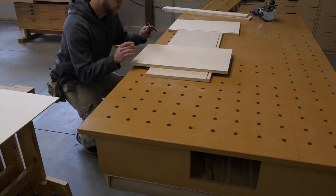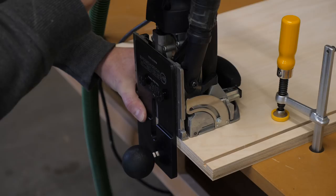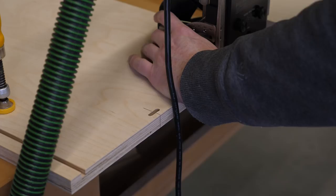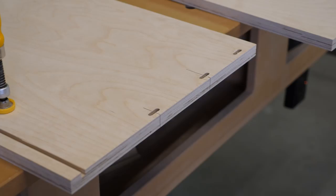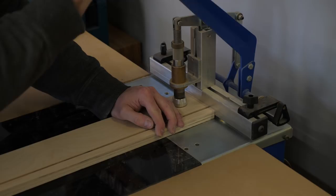On to the joinery. I line up and lay out the bottom and sides and make a couple of tick marks across the seams. I transfer those tick marks around to the ends so they're visible. For cabinet-making duty, the Festool domino normally isn't my first choice — I'm a biscuit joiner kind of gal most of the time. But I'm trying to work on my relationship with the domino, so I added a Seneca Auxiliary Fence, and that seems to have improved it to tolerable.